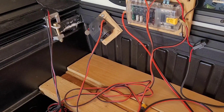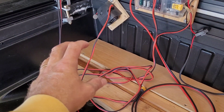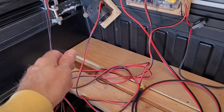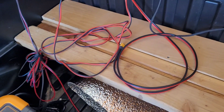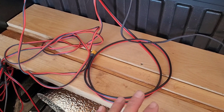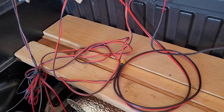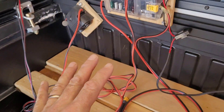I didn't actually believe it was all that dangerous until one day I was running my trolling motor and the motor got switched to the on position while I was up against the shore. The propeller couldn't move because it was against a bush, and within 30 seconds that motor trying to pull through regular trolling motor wire heated everything up — the wires caught fire, the insulation caught fire, and the lead terminals on the battery melted and were dripping into my boat. All of that in about 30 seconds to a minute. So you do need to fuse and protect it.